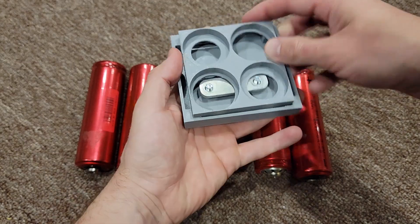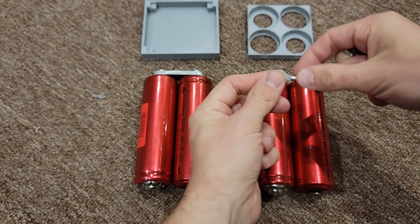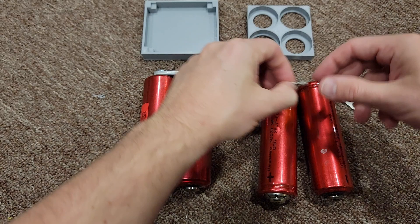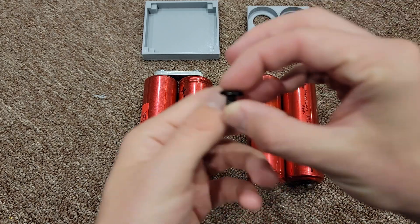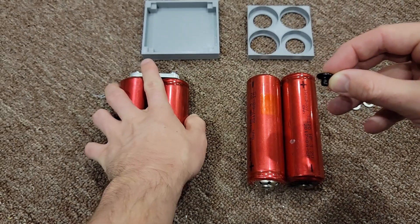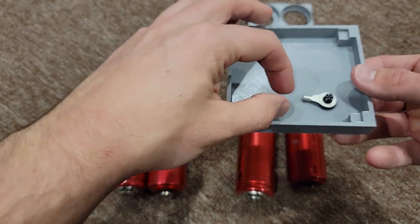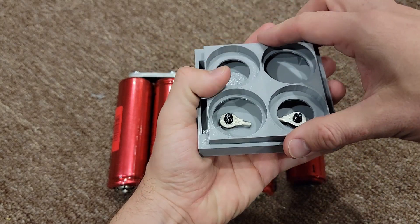Because of the space issue, I realized I had to come up with a different solution to mate these Headway cells. After some thinking, I realized the best option for the least amount of space were ring terminals — all I'd have to do is solder a cable between them, and it would be substantially thinner than the quarter-inch thick terminal plate. I also upgraded the screws to flat hex-head screws from Amazon, which further reduces the space between the battery and the box when assembled.